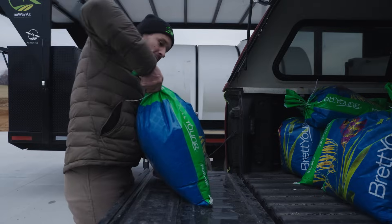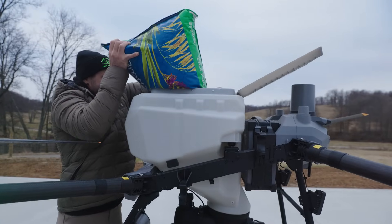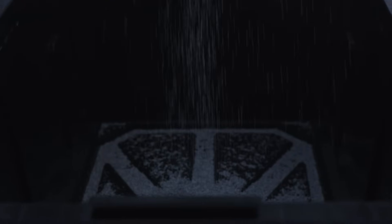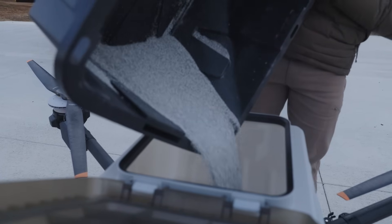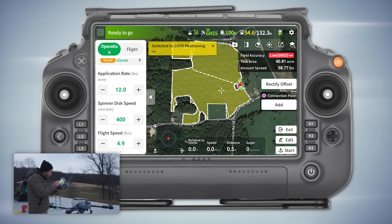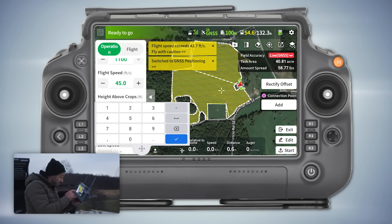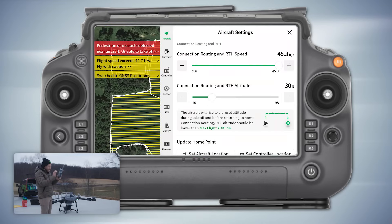Add new material, auger next. I've got to put 44 pounds in it — okay, we weighed some of these out: 47.8. Look how that auger works, that is neat. Look how little the seed is — that is tiny. Calibrating. We added our material — I'm going to choose it: it's clover, small, application rate 12 pounds to the acre. We're going to go 1,100 disk speed, flight speed — let's see how fast it can go at 12 pounds. Shows it can go 45. Crop height 25, route spacing 25. Check all my settings one more time.